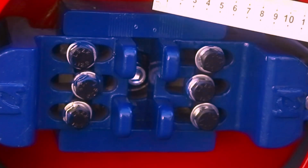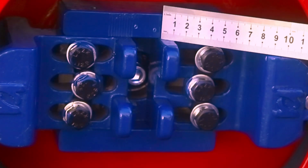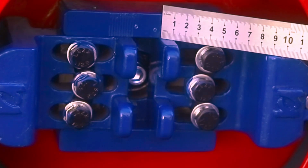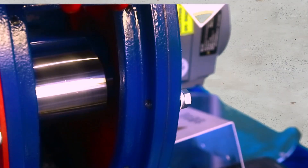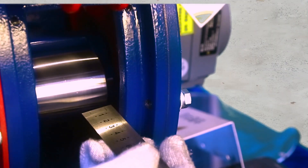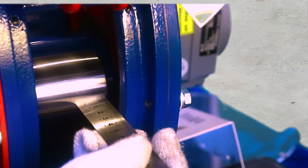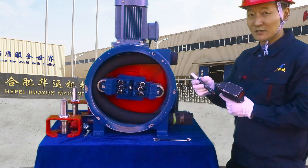Note: the position of the pressure roller bracket at this time is the factory-set initial outlet pressure value of the hose pump. Before replacing the hose or adjusting the pressure value, please be sure to mark this initial zero value, or measure the distance between the highest position of the pressure roller and the inner wall of the pump shell to determine the initial zero position. The initial zero position distance of this pump is 25.2 millimeters.